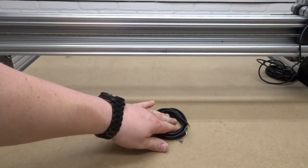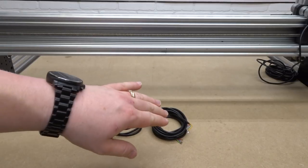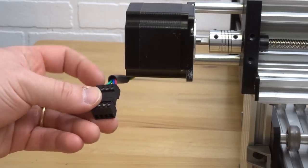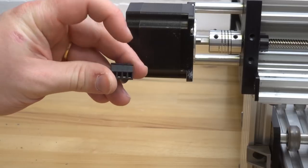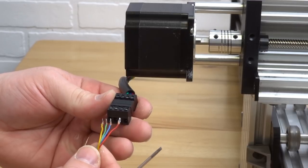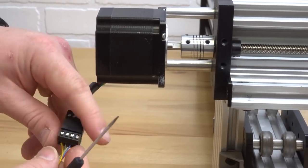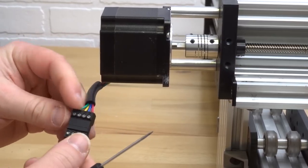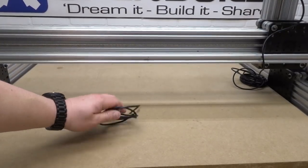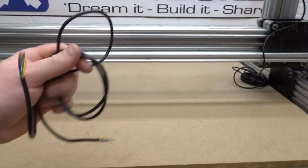For the next motor we'll use our seven-foot cable for the X-axis. Since we're facing the back of the machine, it's on the left side. Just like our other motors, the connection system is already attached — loosen those pins first and insert the wire in the corresponding color order: red, blue, green, and yellow. Give those a tug, make sure they're fully inserted, and then let's move to the Y2 motor on the right side using the three-foot cable.